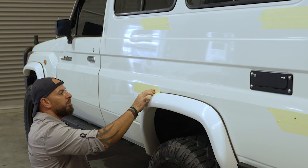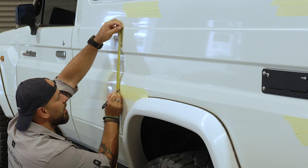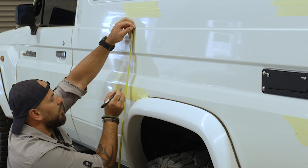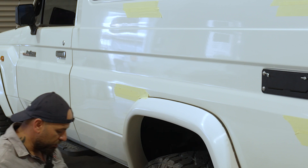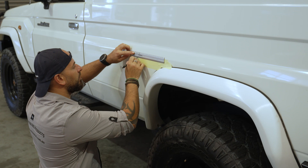For the front bracket, we're going to mark a cross line here. We're going to take the same dimension from the top crease — mark your 300mm, then 100mm to the back, and mark another 300mm. After you have two marks there, draw a straight line.